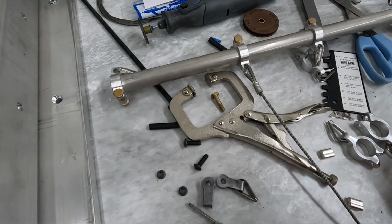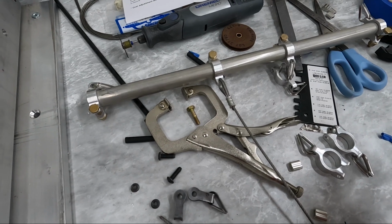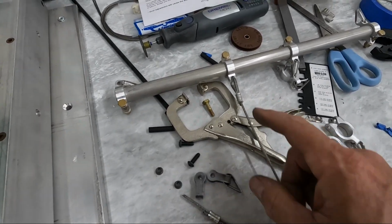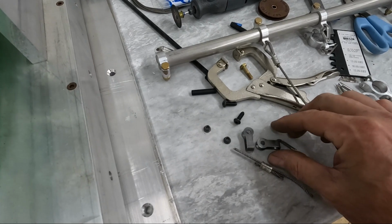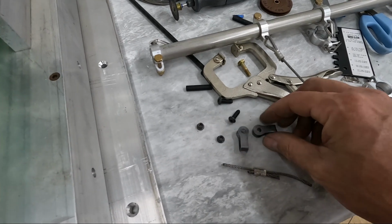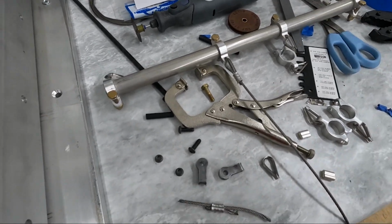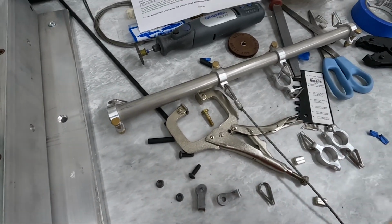So we're just going to try and make sure we get as close to that as possible. I think that's 55 and 1/16 of an inch is basically what that 1400 millimeters is. So I'm going to go ahead and cut this cable off, assume this one's good. I'm going to make another one right here that looks identical, and then we'll go ahead and crimp these ends on next. The nice thing about this end is I can take this off and just crimp this on there and then slip it on there later, so I don't have to maneuver around trying to crimp stuff on the end of this. But I think I've got the tool figured out. I think I can crimp it well here, and we'll just keep going and try the next one.